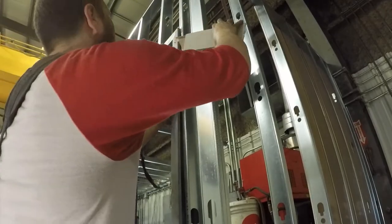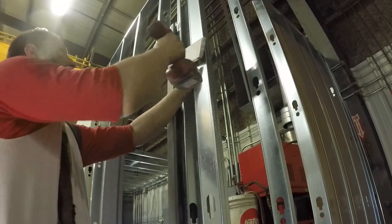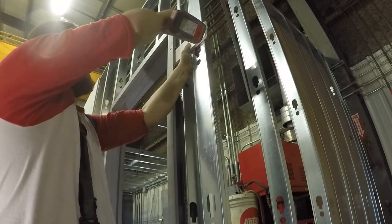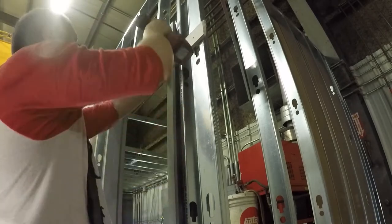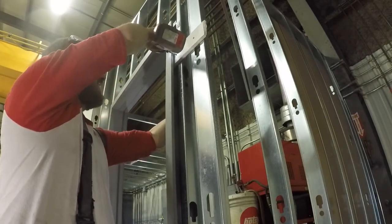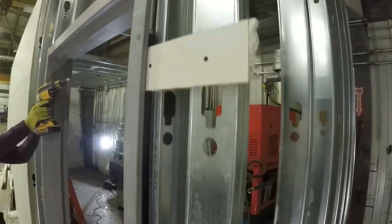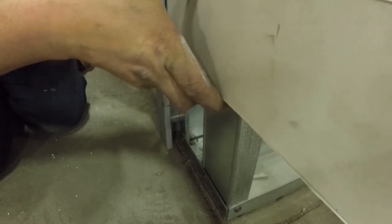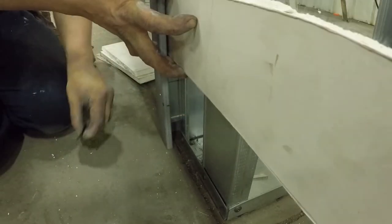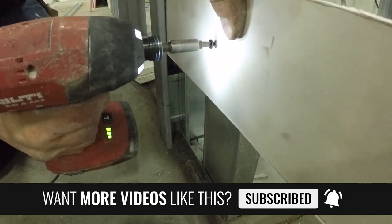And then of course the video you're watching — how to install it. Door clips are easy; if you don't have them, just clip them in, you'll figure it out. I always cut the fold-over tabs out and I always screw in through the stud. The clips that have the tabs, I cut them off anyway. Use drywall spacers for the size of drywall on that wall — if it's half inch, double five-eighths, or a single five-eighths, use the right drywall thickness spacers. Put one in the bottom and one in the top so your drywall is going to fit.